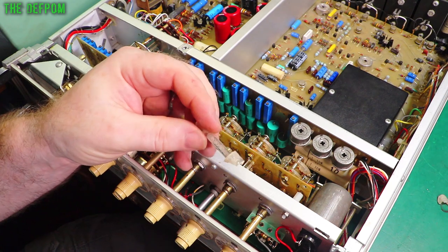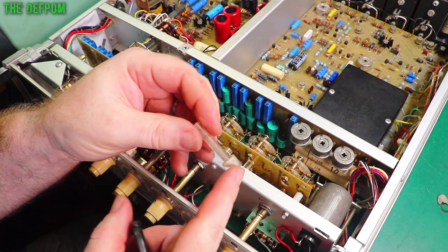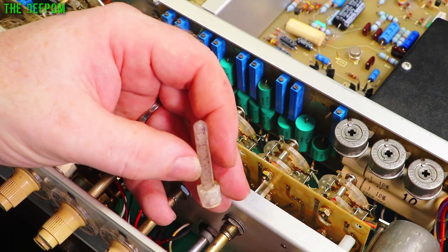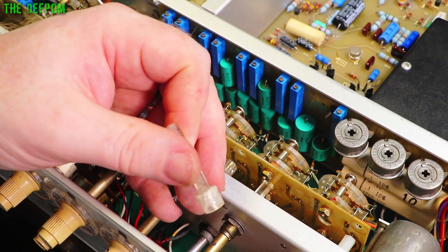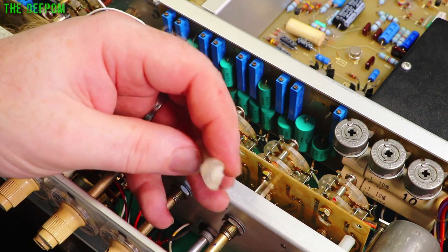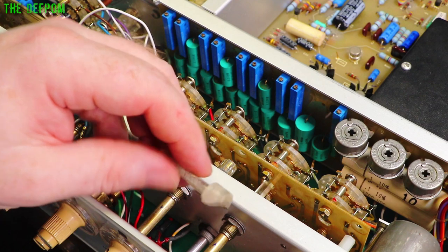It's actually due to a manufacturing fault. This has actually been repaired before — it's glued over the outside of it. But you can see all the bubbles in it. These bubbles are not supposed to be there. That means the material was wet when they made that particular part. So that is a really, really bad one. It should not have been produced — it should have been thrown away.